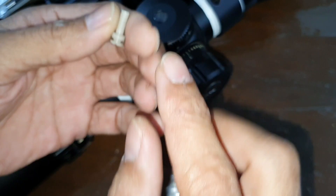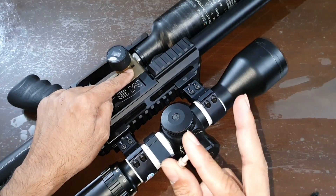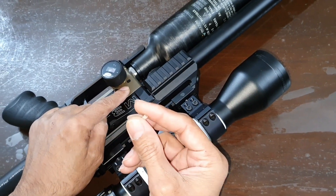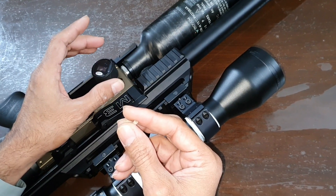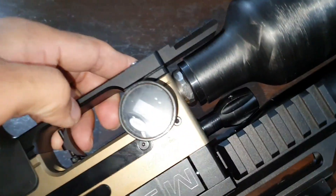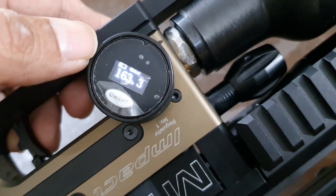I made two PEEK pistons and installed one in the first regulator. Since we keep the first regulator from 150 bar and above, the higher pressure actually helps the PEEK piston seal properly. I know it's properly machined, so it works fine. You can see it is sealing properly and holding — it's been moving within just two bars for the last three days, not going upward or downward at all.